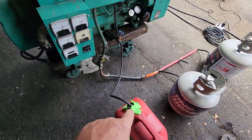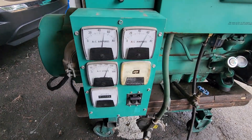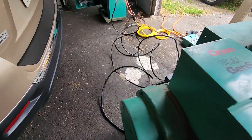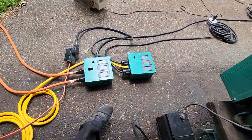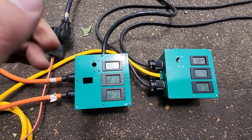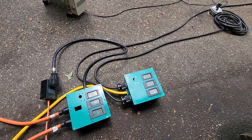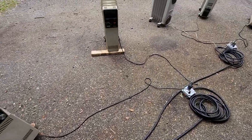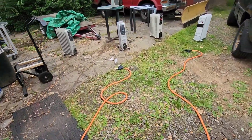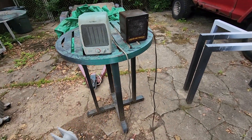Propane — no gas is cool — this is what I want. Right now we've got all our heaters on. This is what we've got on our analog meters — this thing is cranking, it's probably 14,000 watts. The hertz is a little low but that's acceptable; when this thing is unloaded it's about 60 hertz. I should probably raise it to 60 hertz. We've got all these heaters on and we're going to go up to some extra load to see if we can get up to 15 kW.